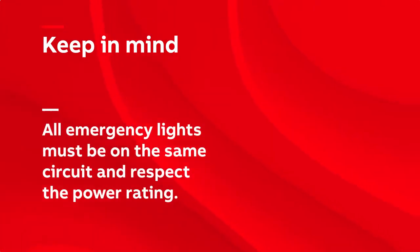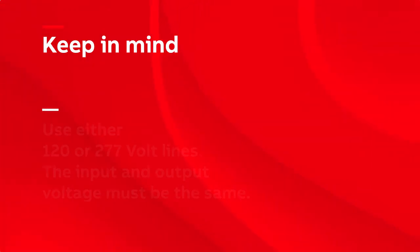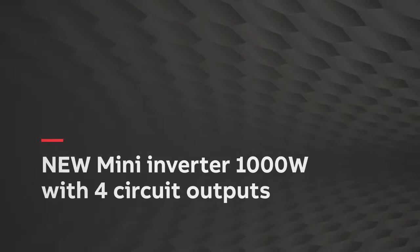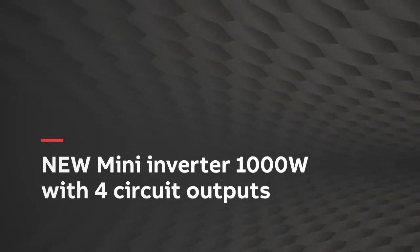For all wiring scenarios, here are some things to keep in mind. All emergency lights must be on the same circuit and fit the power rating. Use either 120 or 277 volt lines. The input and output voltage must be the same. New Mini Inverter 1000 watts with 4 circuit outputs.